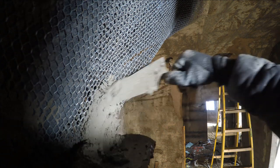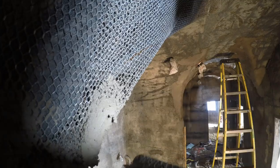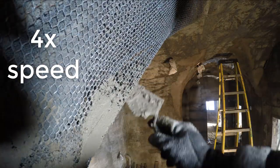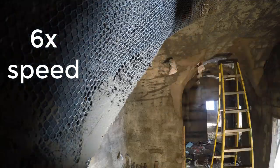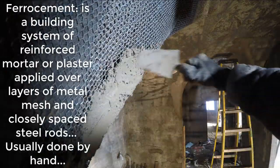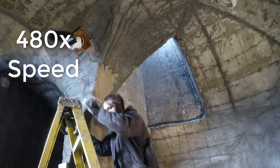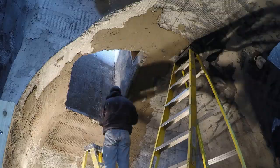In these corners there are multiple layers of lath and a layer of screen between them — just the way we built this up. That video is up in the top right corner. The screen in between stopped the shotcrete and ended up leaving some voids. These things are hard to see on film, but in the worst spots there are several inches of gap between the layers that need to be filled. When filling that large of a gap, you just take your time and pack it in until you can't get any more to pack in — felt like I was doing a ferro cement house.